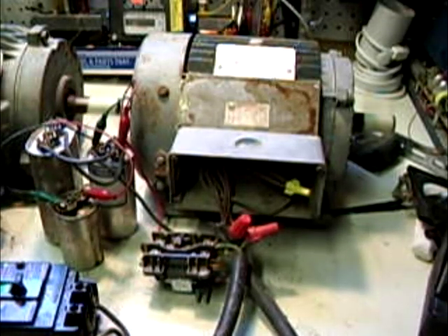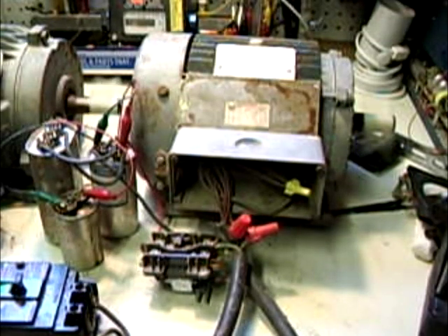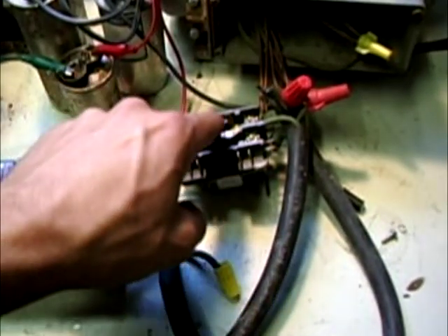Basically, it's a momentary contact switch circuit using your capacitors as starting capacitors to start your three-phase motor generator. There is no need for another motor whatsoever. I got my 220 coming in — and everything comes together like you normally would for doing your three-phase idler motor circuit, except that I've also input this capacitor bank through the third phase right here, which goes just into the third phase, which is also combined with the output to the other motor. When I press this contactor, it puts this capacitor bank as part of this circuit, and all I have to do is let it start this motor and let go and it's going.